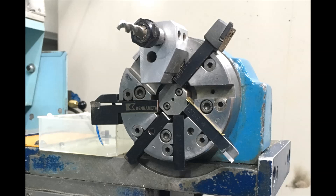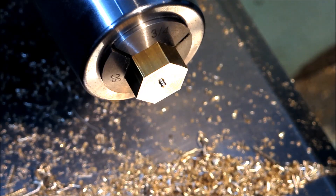When I ran the first one I'd forgotten that I'd actually changed the parting tool from tool position 7 to tool 8, and wondered why the turret had missed a change. It hadn't missed a change at all — I'd just forgotten to change the number in the code.